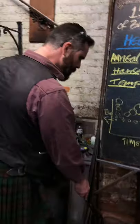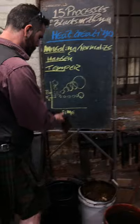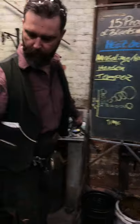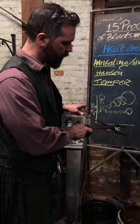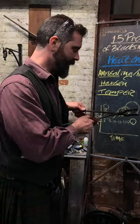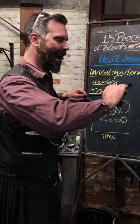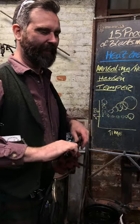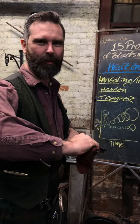All right. So that's brought that down pretty well. Be nice to yourself. Wipe the excess oil off your tongs, because later on, when that has shellacked and you basically have jelly on the reins of your tongs, and you grab a hold of it and go, what the hell was that? And then you get it hot and it starts dribbling down onto you.